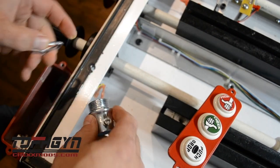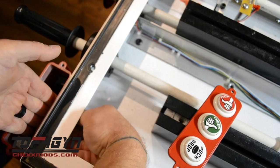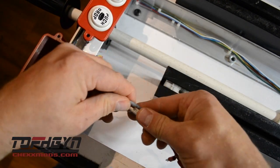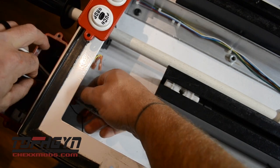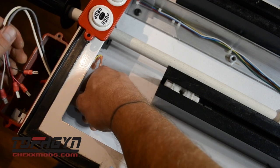Make sure it is level and press firmly. Install the metal fitting and securely tighten. Run the white multi-conductor wire with the red and black pause button wire through the metal fitting and into the box. It may be easier to gently fold over the wires when running them through the fitting. Be careful not to pull too hard in case one of the ends is caught.